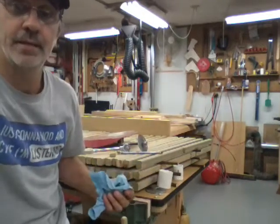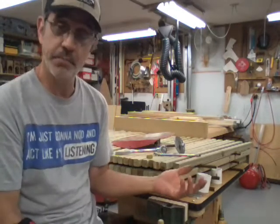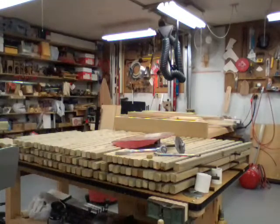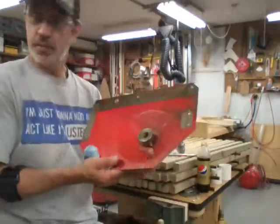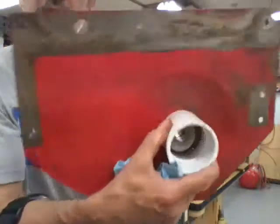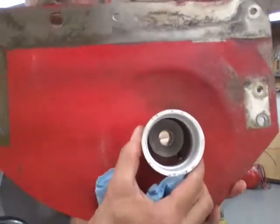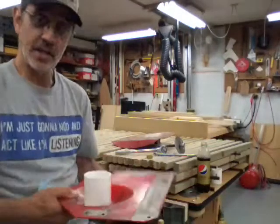If you do have any trouble, send me an email or put something in the comment box below — everybody can read it and benefit from it, and I will answer it. The other side is basically the same. You use your two-inch coupler — it will span the bushing, and you can see the grease fitting down there. It just makes it over the top of both of them. So that's how you push it in or push it out, whatever direction you're going.